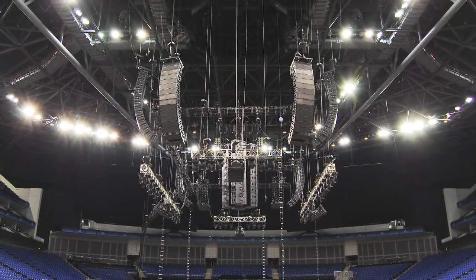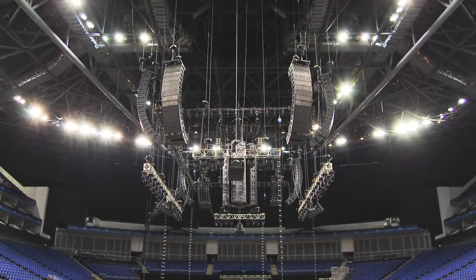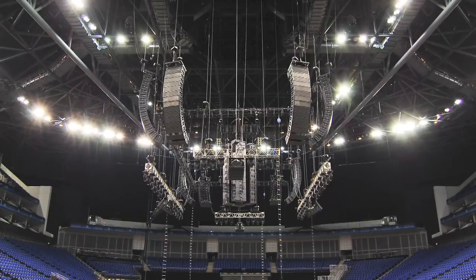With 10 loudspeakers we had to EQ out a little bit around 30 to 35 Hz to get the stage really clear. With 12 we would not have to do that, but using 12 in one array is one ton more of weight — eight more boxes — and especially the height becomes a problem because in most arenas we only have about 20 meters or 60 feet of clearance, and in some arenas even less.